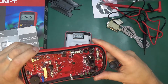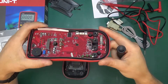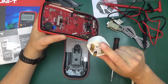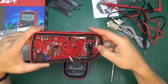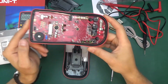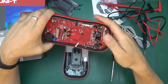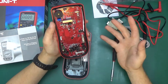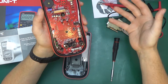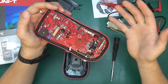Here and here are HRC fuses — and what's so special about them is these are BS 1362. At least if you're in the UK, those fuses are readily available pretty much anywhere because these are the same fuses that are in a UK plug. Every UK plug is fused by default with a 13-amp fuse, and BS 1362 defines the size — it's also a high-rupture-capacity fuse. They are widely available and a lot cheaper because they are mass produced. A lot of meters have some special Bussmann fuse where the only place to find a replacement is online with a week's wait. These are readily available and that's brilliant.